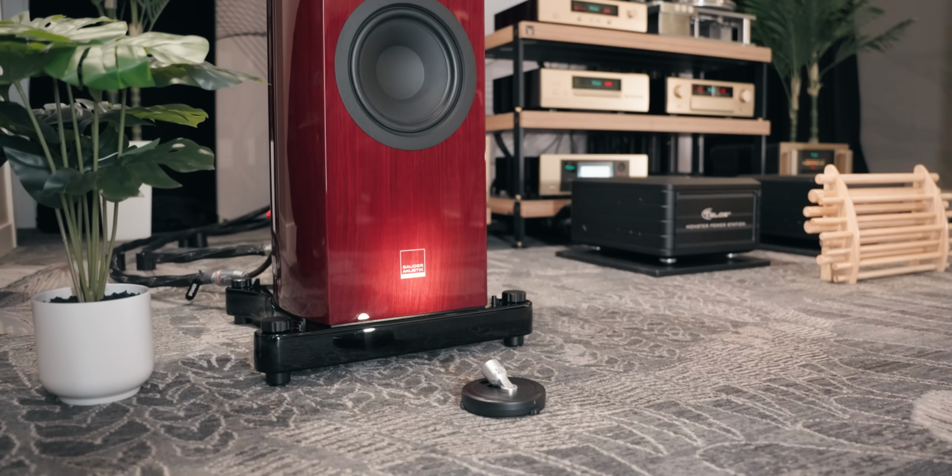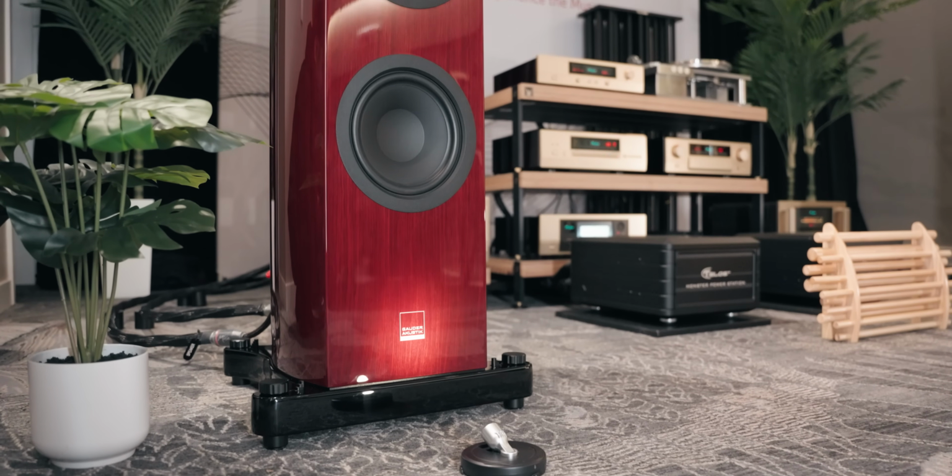And I found that interesting because when I measured the speakers, I took a look at the impulse response. It was very clean. But also the frequency response was very linear. It was like plus minus 2 dB from mid-range and up. And the off-axis, the horizontal and vertical, were both very impressive. So do you mathematically calculate all this? Do you calculate with software? I know you're a mathematician by trade, if I'm correct.